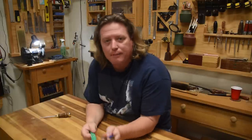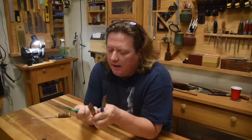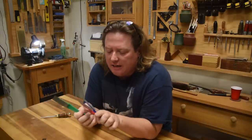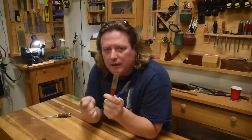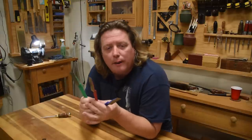For this application I'm a real big fan of these DMT little slip stones. You can buy them really inexpensively, and they come in kind of a coarse, medium, fine setting - blue for coarse, medium, and then fine. Just like whenever you sharpen your chisels, you always start at the lower grits and work your way up to get rid of any burrs. This Forstner bit is quite dull, so I'm going to go through each one of the grits, starting with the blue.